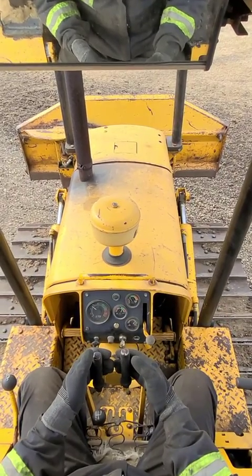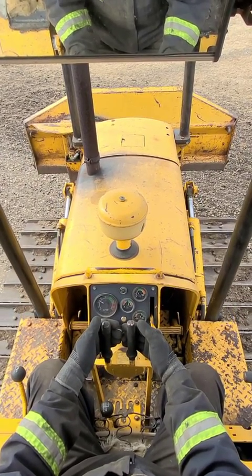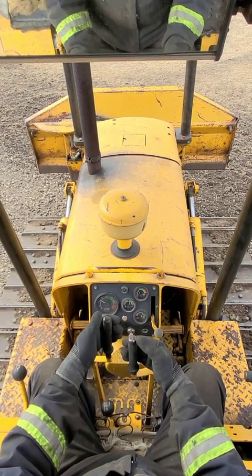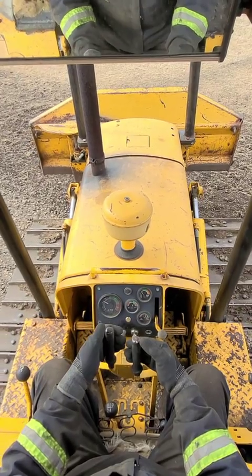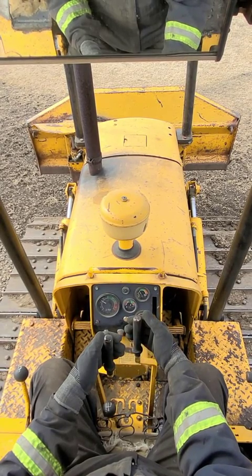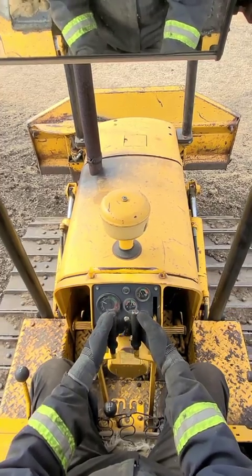That way I can adjust my steering corner. Now I've disengaged both and I'm showing you there's clutch modulation as well for the steering clutches — they're not just simply on and off. Just engaging the one now — I have control of it. Engaging the other one — I also have control of it. Now this isn't the way you'd normally operate a crawler, but as a mechanic it's a good test procedure. A lot of operators will complain about the steering or brakes but can't really describe what's going on, and usually it means they've lost modulation on one or both of them. It's a good check to do as a mechanic.